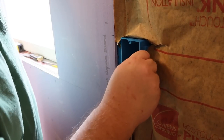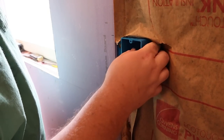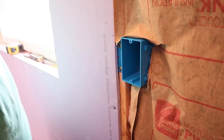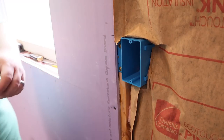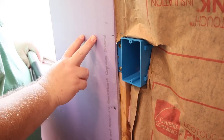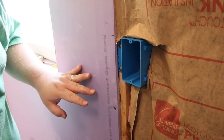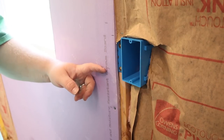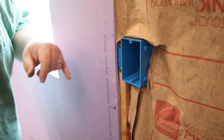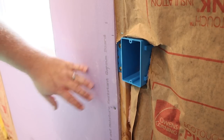A little bit sloppy, but it's got little tabs so the drywall will probably hold it in place really good. Let me tell you about the drywall I chose while I'm stapling it on — it is purple, and this drywall is rated for wet environments. You're supposed to use treated drywall in bathrooms and kitchens or anywhere that might be exposed to higher levels of humidity or moisture. We put this in our bathroom and bedroom already. Two dollars per sheet is cheap insurance to prevent mold and moisture — well worth it in my case.